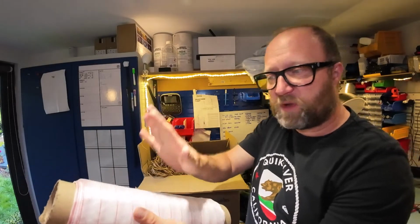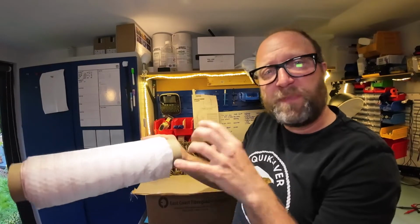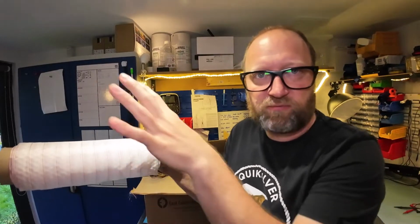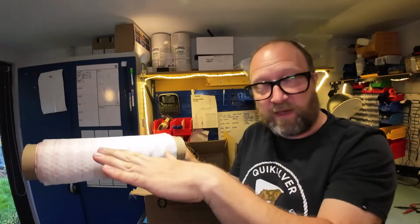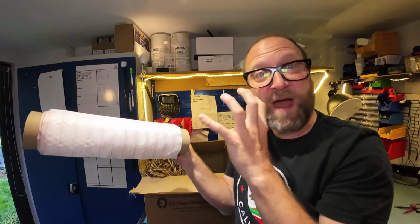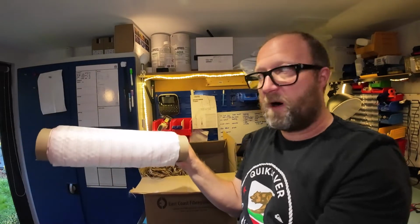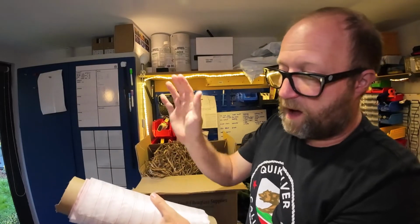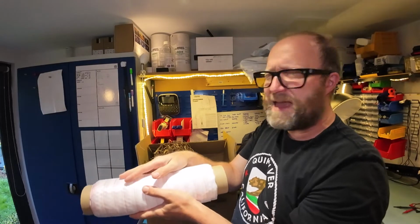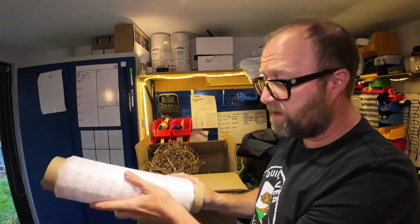And what this does, it does two things. It's intended to be used in between layering, so you can do 1, 2, sometimes maybe you get away with 3 layers of fiberglass in one sitting. Put a layer of this on, peel it off after cured, and it presents you with a ready surface to continue epoxy layering on top of, fiberglass layering on top of. Somehow it gets rid of all the amine blushing effect, and also you don't need to sand. So that's a benefit of this.